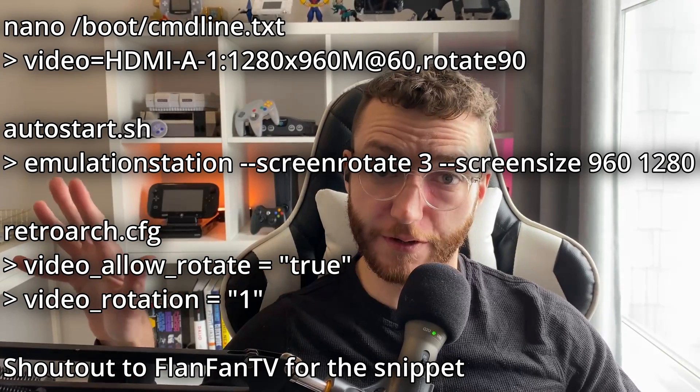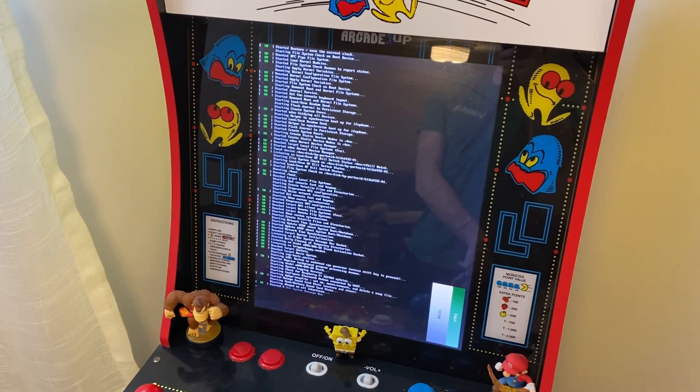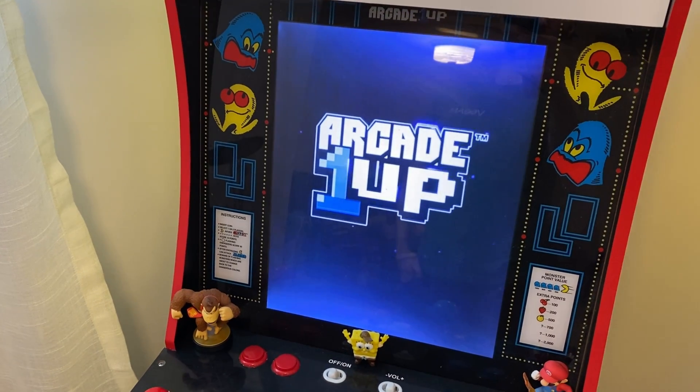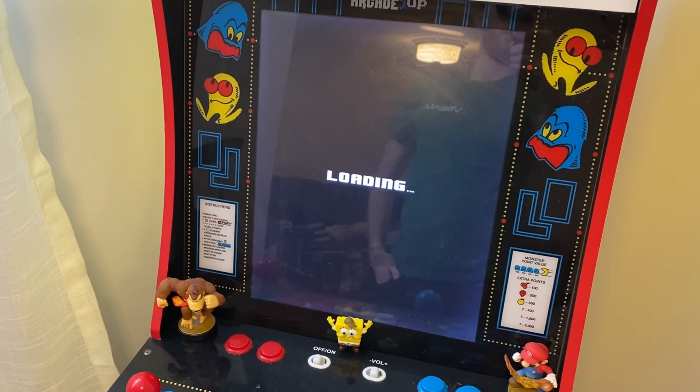The screen orientation was actually quite difficult to set up because a lot of the documentation online talks about older Pis, where there was just a little config file you could flip. On the newer Pi it ended up being a line I had to add to a startup script that flips the resolution while booting to get it in the right position. I'll add those codes overlaid on the video or in the description so if you're banging your head against the wall like I was, you'll have it easily accessible. Also, if you're wondering how I got the original Arcade 1-Up animations back after RetroPie was installed, there's a section in settings called something like splash screens — search online for rips of those animations or cooler ones, FTP them onto the Pi, and I'll leave a link in the description.